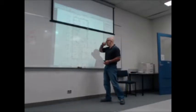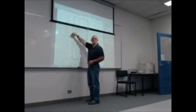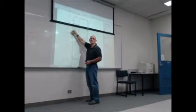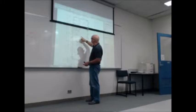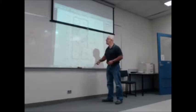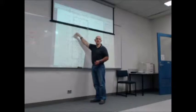Do you need to work out every area? Take out things like the bath, because you're not going to tile that bath. But remember to add on hobs. Work out whether it's a poly marble or a tile shower base. Take out your vanity. Easiest way is to work out the area of the room and then take it out, rather than take little bits out. Okay?